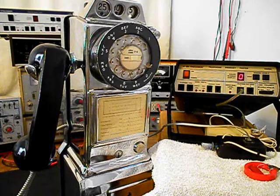It has a button on it. When I press the button, I can give dial tone or take it away at any time. And since it's an open amplifier, it is prone to any static interference or noise in the atmosphere. And if you hear any noise during the final checkout, it will be coming from the amplifier and not the payphone.